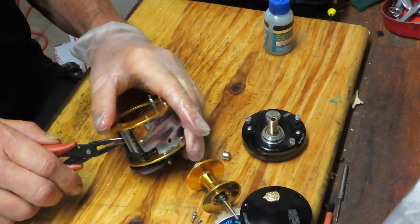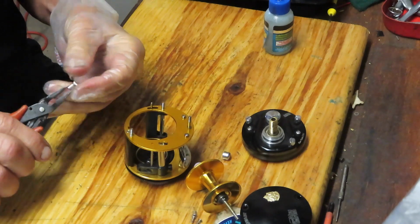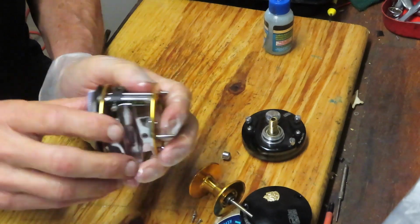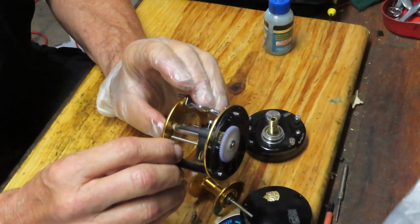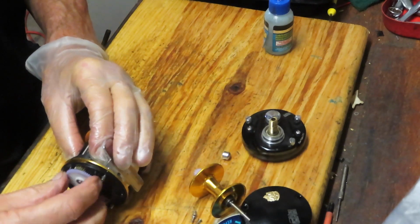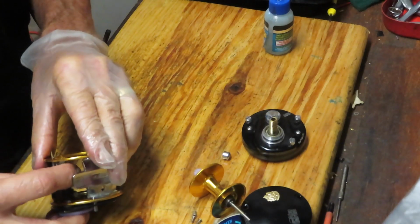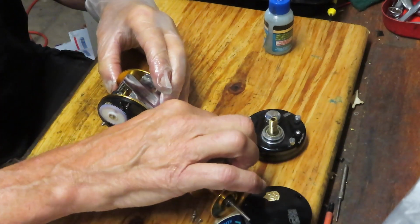So I just use the pliers and, in a couple of attempts, we'll get that back in there. We'll be able to oil it and move on. Just like that. And now that's proud. That's not riding in the worm gear yet, so hold the pressure on it, turn the wheel, and you will eventually line that up. When it comes down like that, you're perfectly lined.